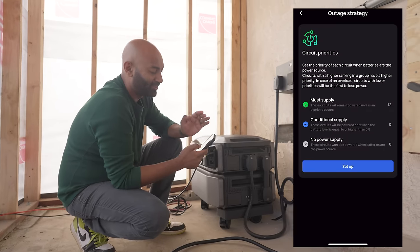That pretty much is a look at our initial setup. So what have we done so far? Well, we have swapped out that ugly old service panel that we had here, and then we had the smart home panel off to the side. All that is replaced by this beauty right here. From here, we now have complete backup of all of our loads in this panel. Because this office only had 100 amp or 60 amp service to begin with, we can back up everything and we still have space left over, which is important because we need a new circuit, for example, to run lighting in here. We have outlets, and we'll eventually have batteries charging in here, like little hand tools.